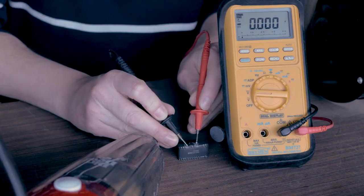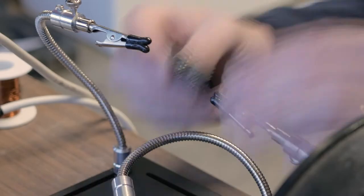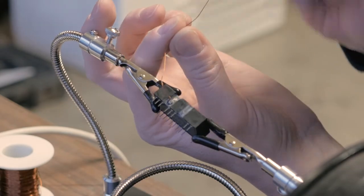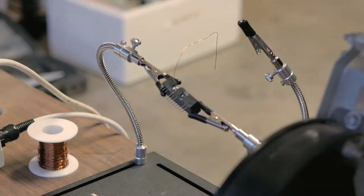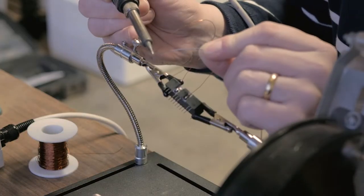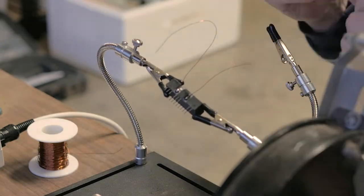The voltmeter confirms, via the bottom portion of the pin, that this is a clean break at approximately zero volts. I solder a jumper wire to this bottom portion of pin 16 and another to pin 20. Note that any insulated wire will do. In this case I'm using enameled wire, sometimes called magnet or transformer wire. On both ends of each strand, I've burned off the enamel and tinned the tip, ready for soldering.